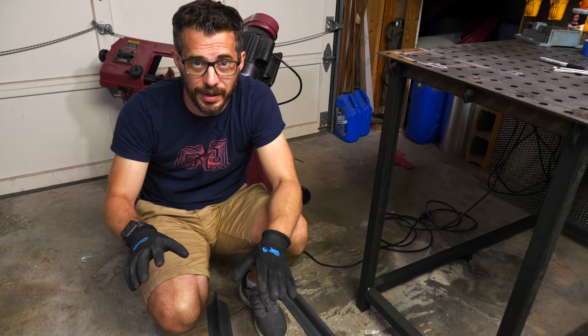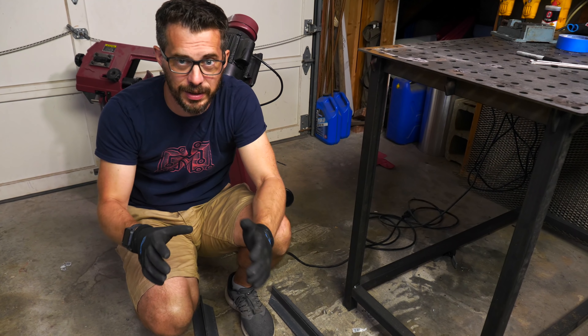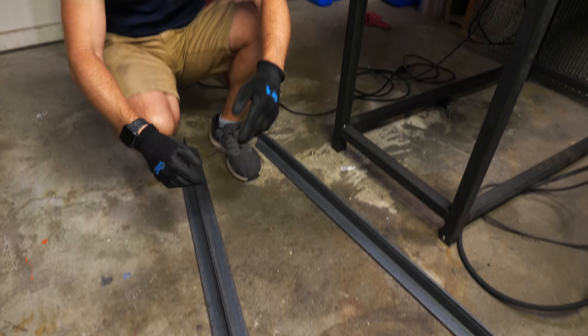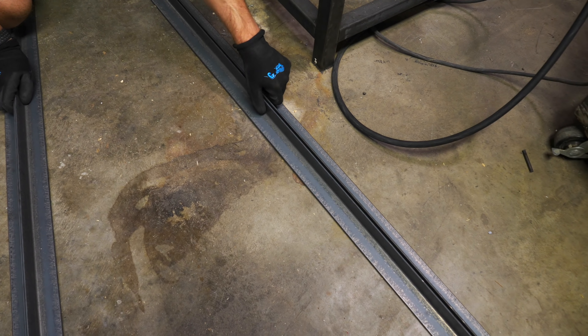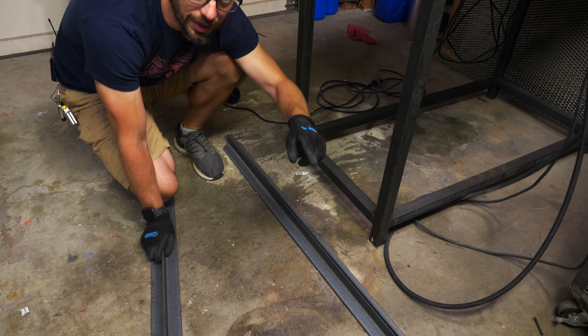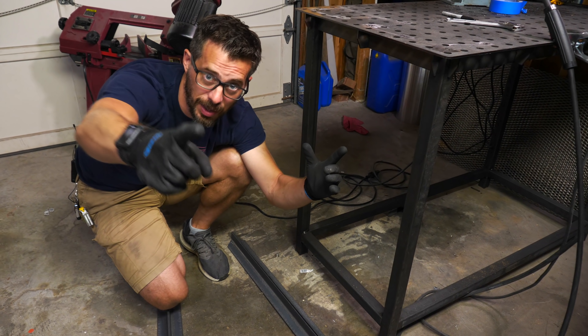I got all these pieces cut down and I started to put together the frames — just the four pieces — and I realized that they didn't actually match up into a rectangle. I wondered why, because I definitely checked the angle and the lengths are exactly the same. But then I realized that one of these pieces is actually not straight. You can see them back to back, end to end — one of them has flex in it. Just wanted to give you a little encouragement: if you cut down pieces like this and they don't quite line up, it could be that the material is actually a little bit bent. I think we can correct that once we weld it all together. And since this is basically just a whole bunch of welding, it's montage time.